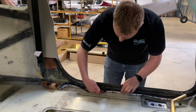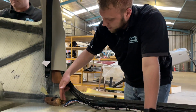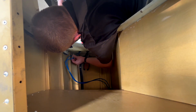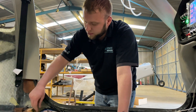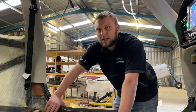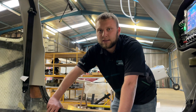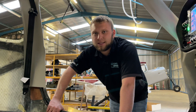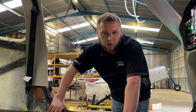Coming down this side, you can see this bundle of wires that goes through the floor. We have all of our tail wiring as well as the two oxygen tubes from the AVI-64 for pilot and co-pilot positions. The tail wiring includes the pitch servo, the ELT, the magnetometer, the tail beacon, and trim. In this particular aircraft, we've also got a couple of camera wires — one for a taxi cam and the other for a recording camera. That's pretty much it for the down-low wiring.